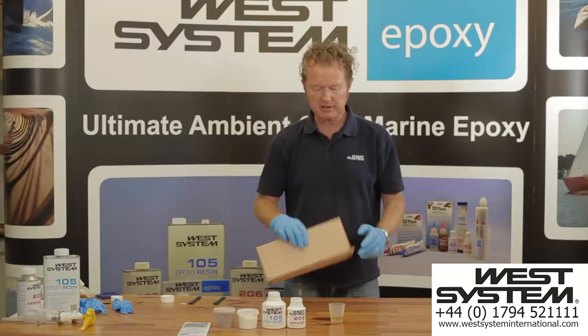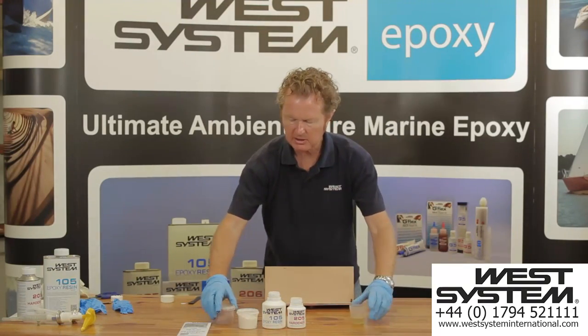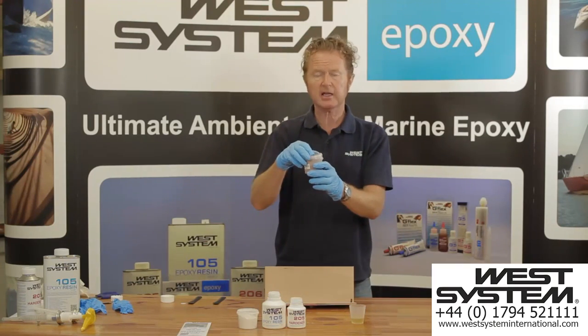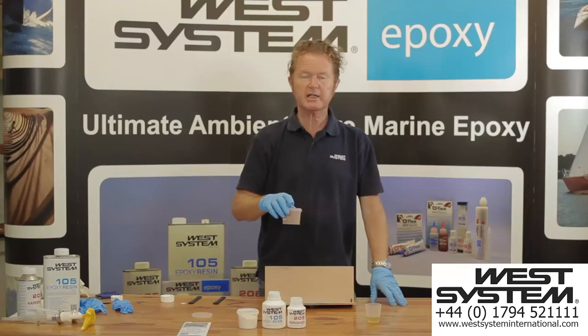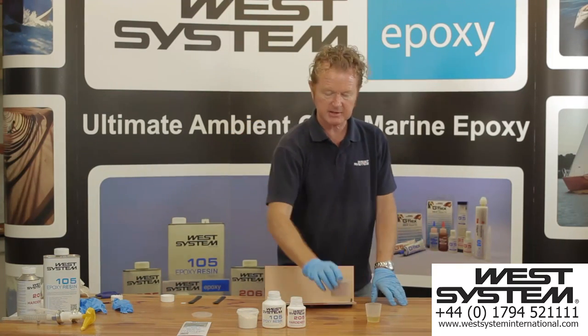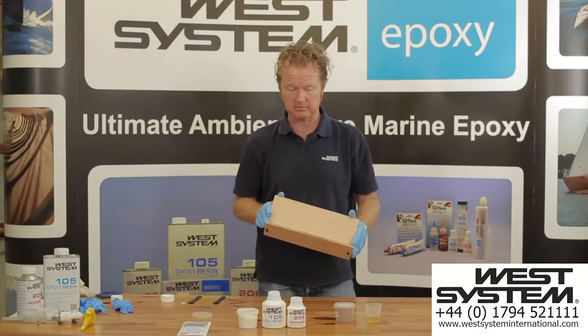And for that, we need to use our West System resin and hardener. But on a small dinghy, we can use our low-density filler. Our low-density filler is a very lightweight filler, really intended for filling and fairing. But on a small dinghy, this will create a very lightweight, very strong fillet that is actually stronger than the surrounding plywood panels.